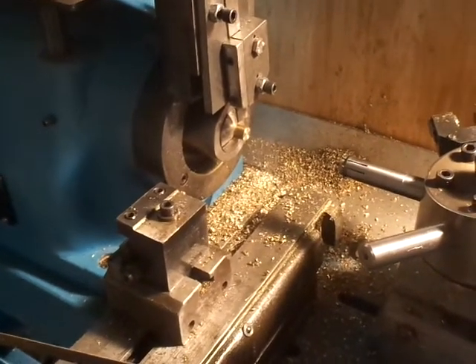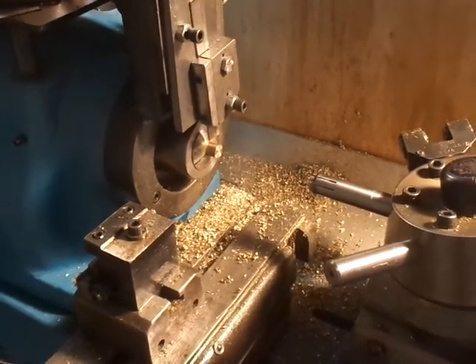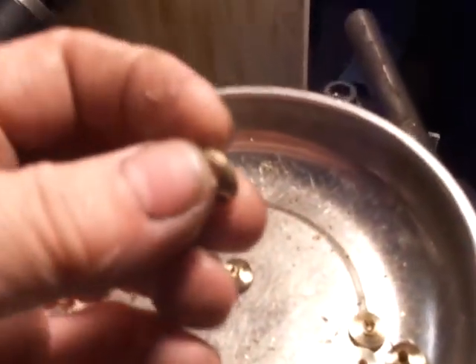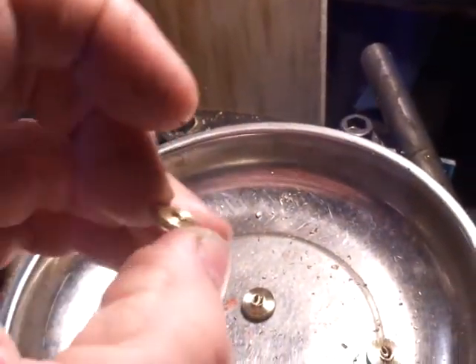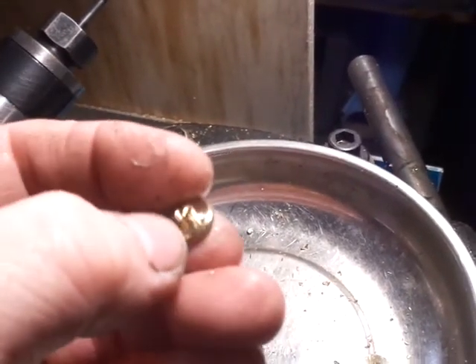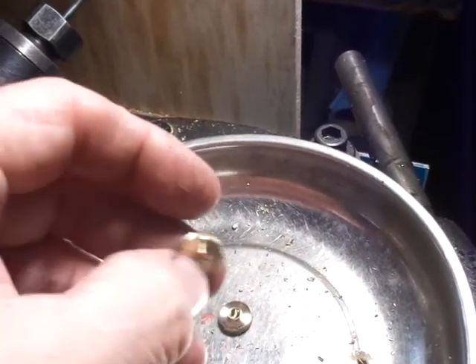This is KM4YB, and thanks for clicking on the video. I'm going to give a demonstration of how I manufacture the parts that go on the keys that I make. I'm making thumb wheels — knurled edge, about an eighth of an inch wide with an 8-32 hole. This will be done in another operation after I make the run of parts here.